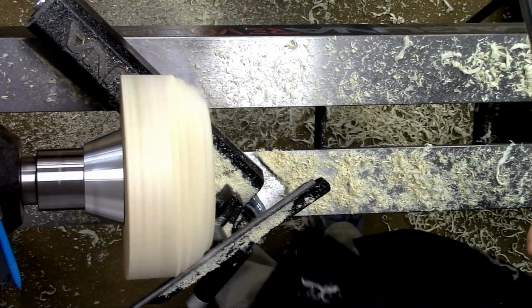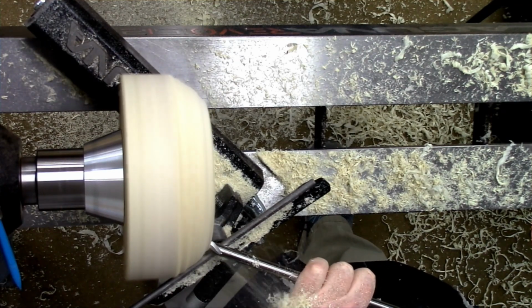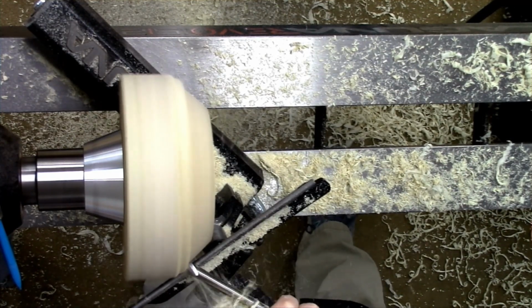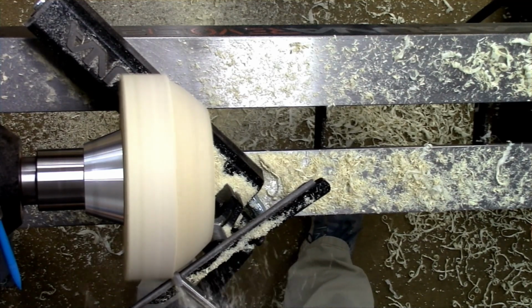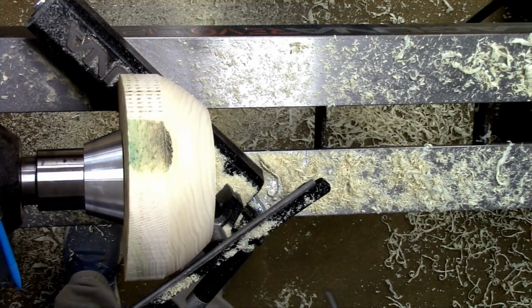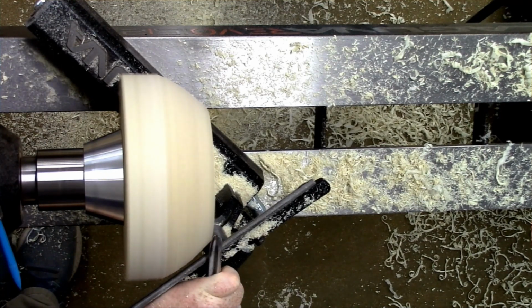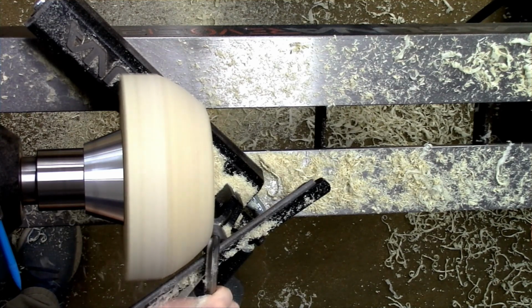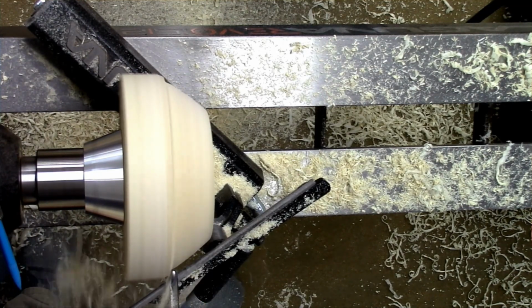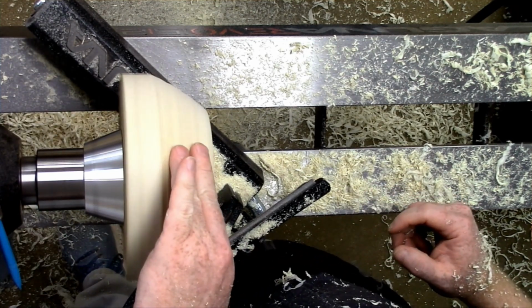All right, standard half inch bowl gouge with kind of an Ellsworth style grind. Just a matter of simply coming in, doing a push cut around the side. Instantly nicer finish. Some people like doing a pull cut, which is you bring this down low, want to engage just the bevel there, pull it through and just pull it back to you. Varying ways to cut the outside of a bowl. Pretty simple, straightforward.